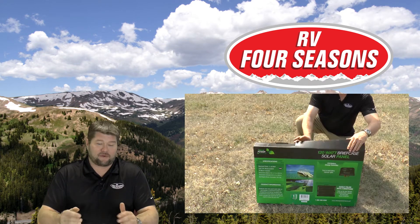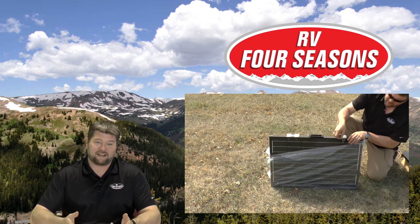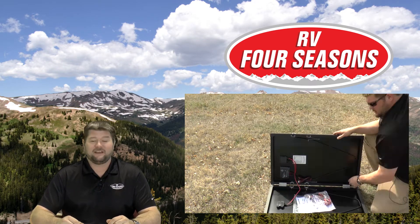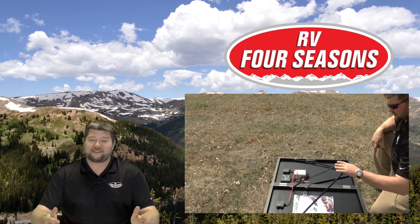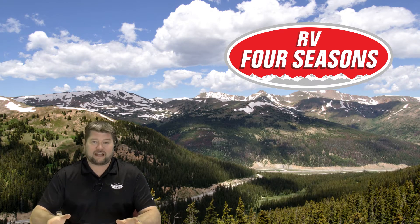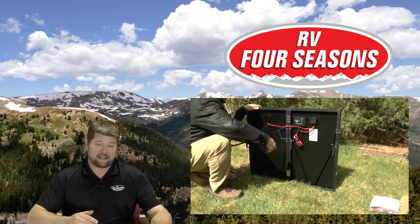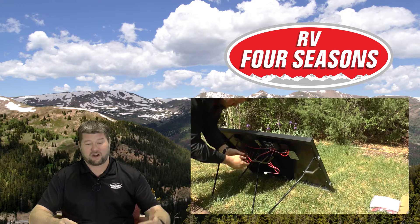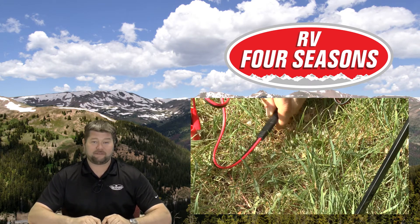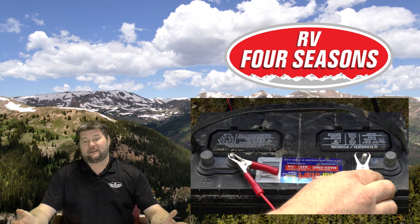I'm going to show the unboxing — there's a plastic cover over the whole thing with styrofoam bumpers on all the corners to protect it during shipping. Once you remove all that and open it up, you have a really nice-looking solar panel. Setup is easy: take it out of the box, open up the panel, put down the landing legs, and connect the wires from the charge controller to your solar port. Hook up the alligator clips to the positive and negative terminals of your battery, and you're off to the races.